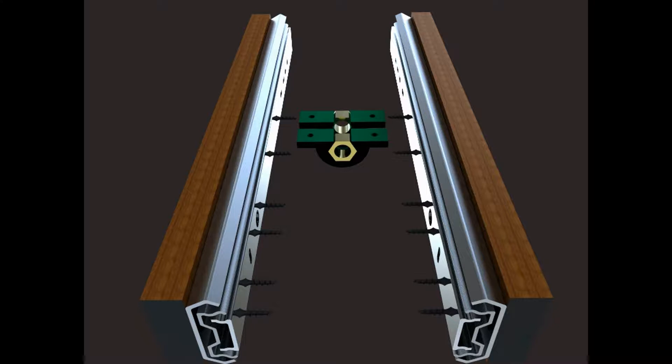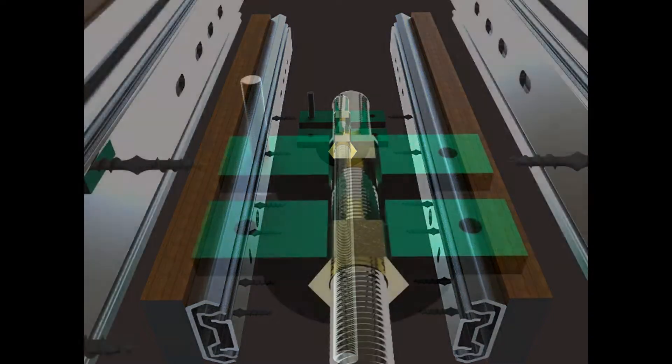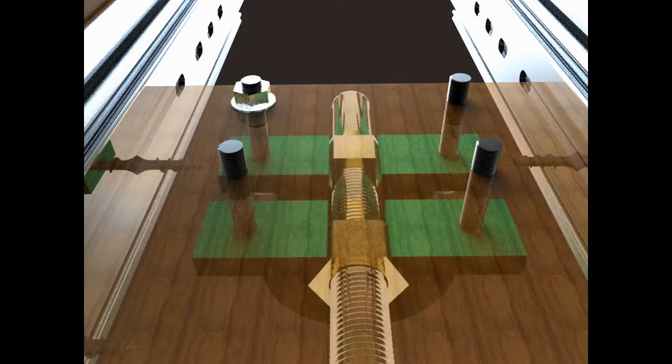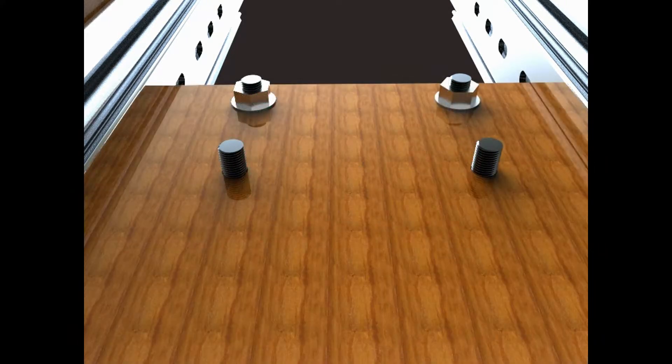Here you can see our anti-backlash device. This is what actually contains our drive shaft and our drive nuts. In between the two nuts — not shown here — is an actual spring that pushes or resists both nuts away from each other. This makes sure that we have tension on our nuts but not so much that they will bind. This creates an anti-backlash. Then we're going to attach this to our back upright. Bolts will be inserted through our anti-backlash device and attach it directly to our upright, or our Z block, that goes up and down. These are held in place on the back wooden piece with locking nuts — fluted nuts, or a nut and washer, with a lock washer preferred.